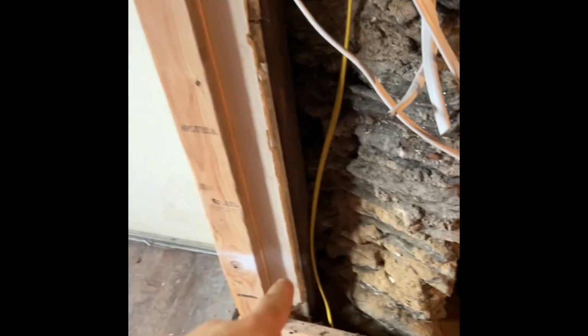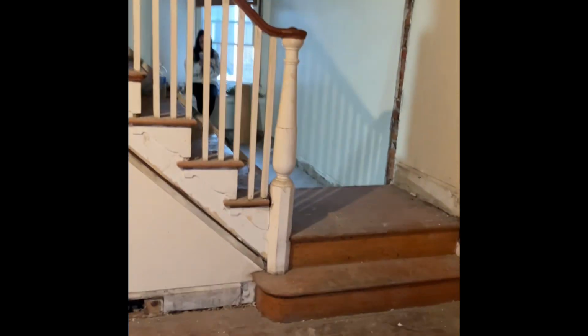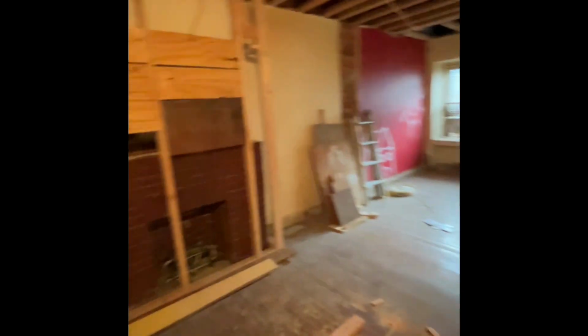This is the home run for the living room for the outlets. So run everything off of this one. You got it right here. Everything's marked with white spray paint. Box here. Another box here. A box there. A box somewhere over here as well. I had it marked as there, but wherever you see easier, there might be the easiest. So this is gonna have 1, 2, 3, 4, 5, 6 boxes. Okay. So living room, 6 electrical boxes.